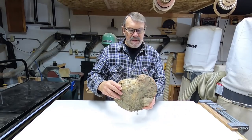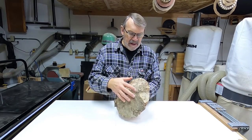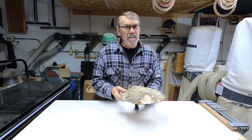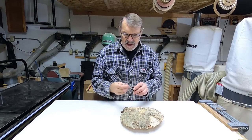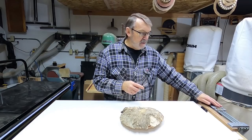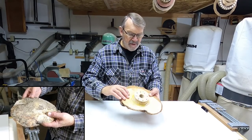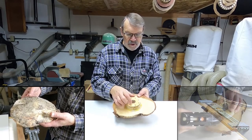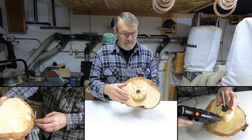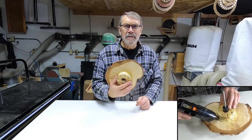About a month ago I cut this piece off of a burl that I was turning. I turned a burl bowl and used a reciprocating saw to cut this off — it's fairly thin. People have asked me what I'm going to do with it, so I decided I'm going to turn this and see what I come up with. I started by taking the rod out of my center finder and put it in my Xylus vise standing up to find the center, then used that center finder to put this chuck on with hot glue. I didn't want to drill a worm screw because it's too thin, so this should work fine.